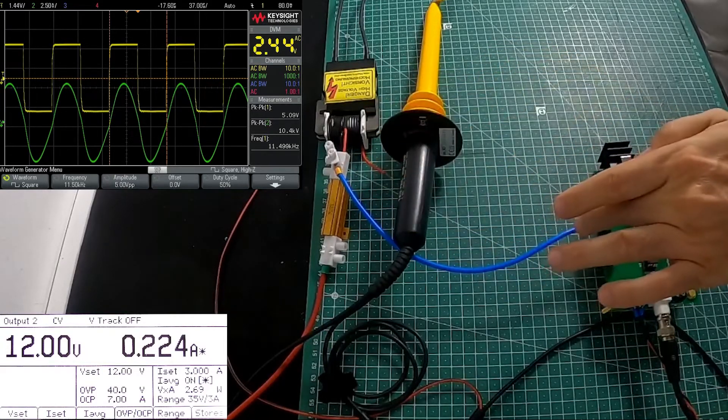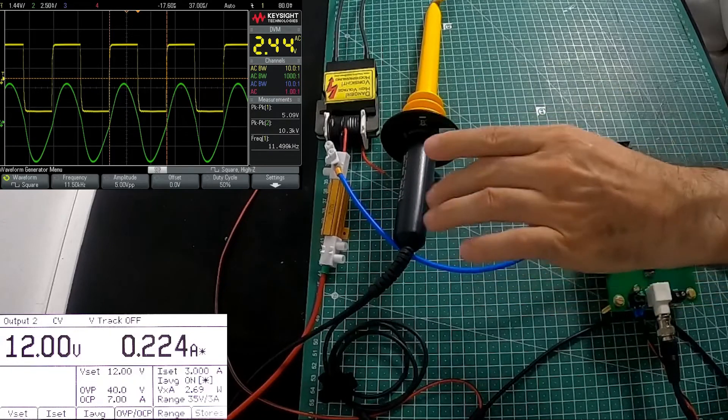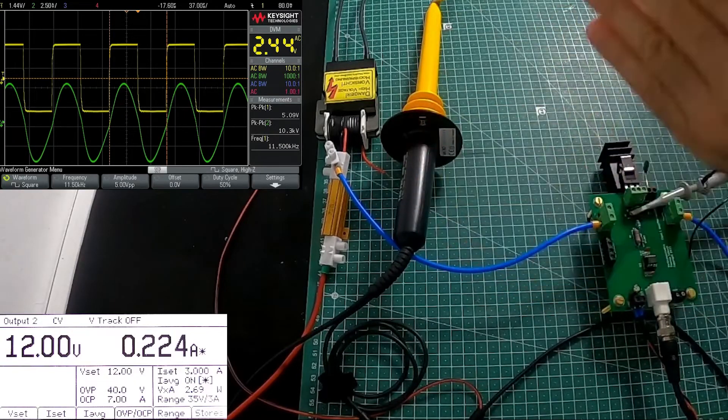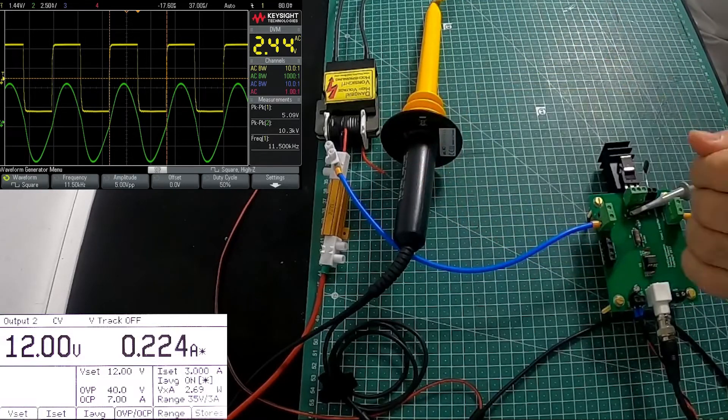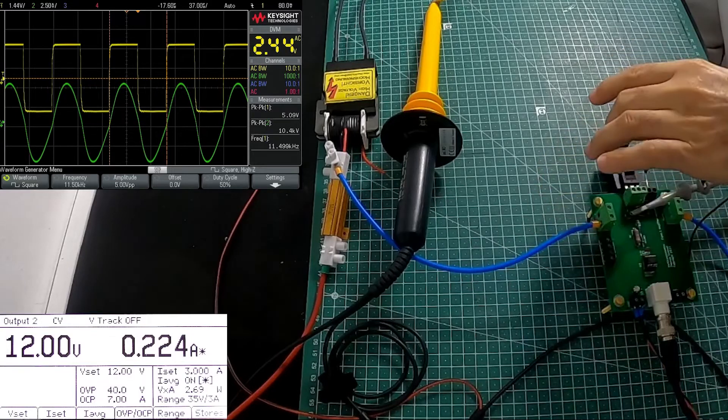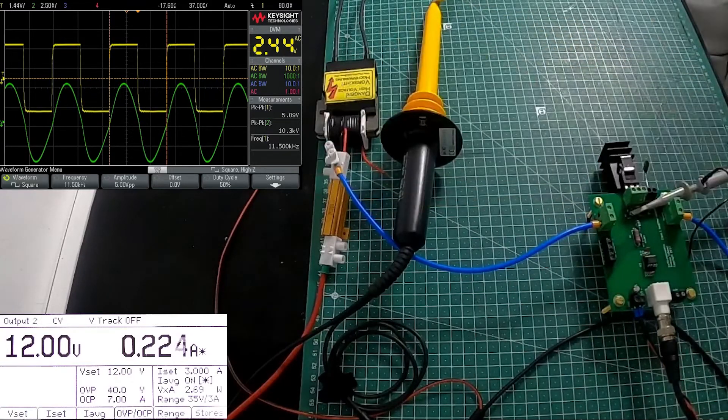What I'm going to do now is add a diode. The diode pushes power through to the coil but doesn't allow backflow. It still doesn't fully fix the back EMF problem — instead of the MOSFET getting hot, the diode gets hot — but a diode can easily deal with this problem. Let's have a look at how that looks in our circuitry.